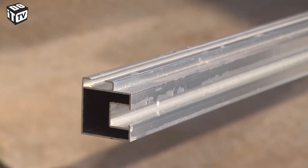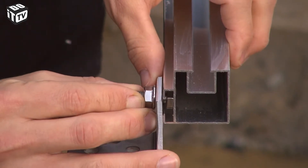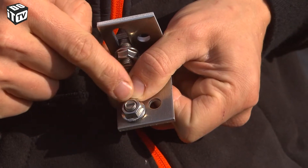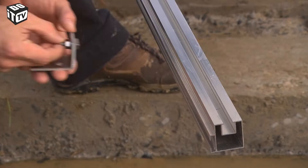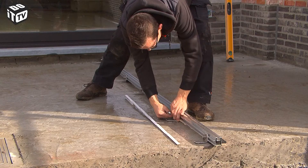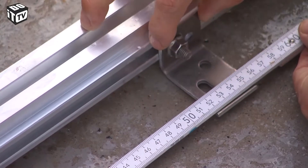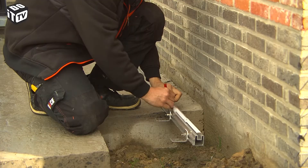The alloy profiles have two slots. Place the brackets in the most shallow slot. The bolts have a groove on the bottom that corresponds with the direction of the mounting plate — this is convenient for fixing the bolts. For the time being, fix them by hand. Position the brackets every 50 cm. If the rails are too long, you will need to shorten them using the hacksaw.